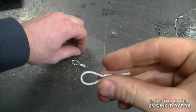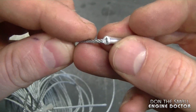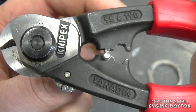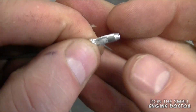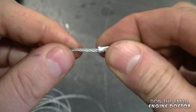Now I'm going to show you a few examples of how you can crimp some ferrules. I'll start with the end cap — once you have your end cap on the cable, just use this part of the crimper and squeeze. It does a nice professional crimp and it's on there nice and tight.